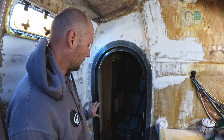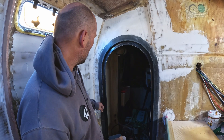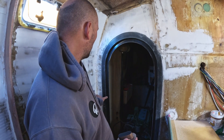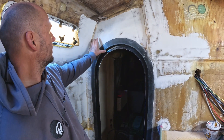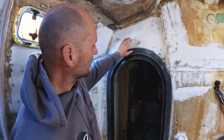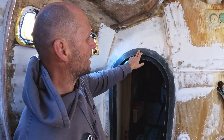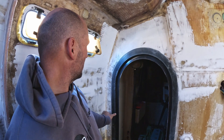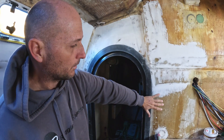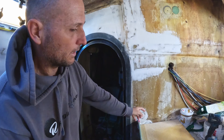So what we do is put an opening that is structural. In the case of this door, it carries some uni in and around it, and that uni turns it into a bit of a beam. This beam carries the load up to this edge and around the flanged area. The load here needs to transfer into this area, which has a lot more surrounding structure, so we can get lighter. We just do it for continuity — to take the load from this beam bit and push it out into all this structure, which can be quite light because there's a lot of material over a large area.